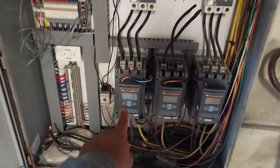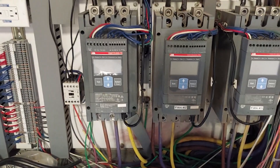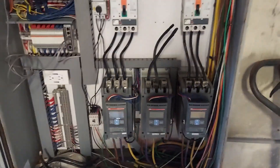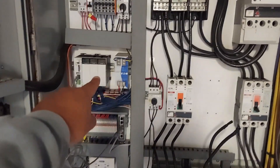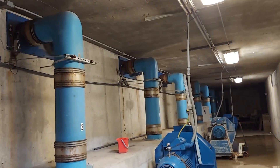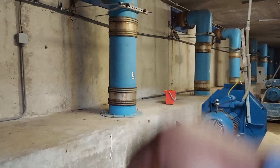Also, the way this is built — these boxes right here are soft starters. So when I turn the motors on, the system is run through a PLC. When I turn the system on, no matter what, automatically it starts the pistons to open and close the valves. So there's not going to be a buildup of pressure in the box before it starts pushing waves into the pool.